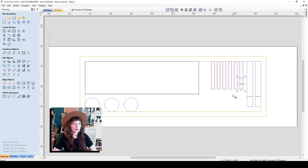So you can see here, all we're doing is drawing rectangles and circles, and then we'll be able to tell the machine, okay, here is the box, cut inside of that box to this specific depth. It's kind of a combination of what you call 2D or 2.5D in this case. You have a 2D vector and the CAM, or computer aided machining, determines the 3D dimensionality of it. So you say cut to this depth within this 2D vector, 2.5D.